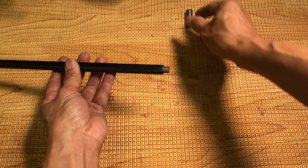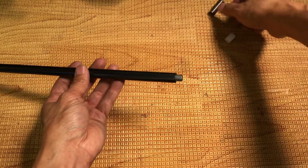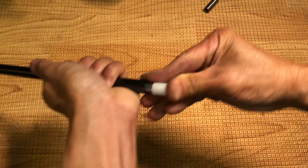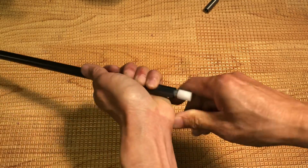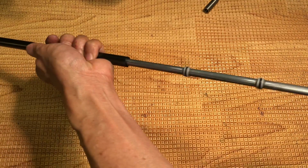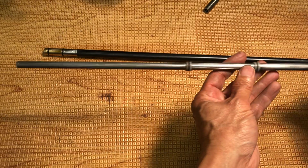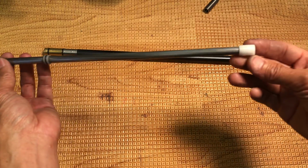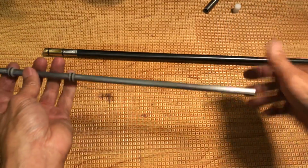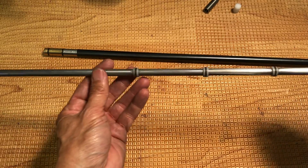I just took out the half inch 20 jam nut here at the end. We go to remove the liner. And here's your liner. This is a 25 caliber, 600 mil in length. I'll take my little handy dandy liner puller. Oh, it is a modification I've done.